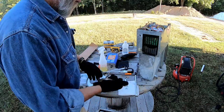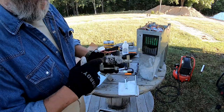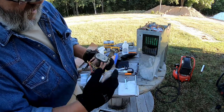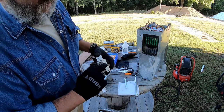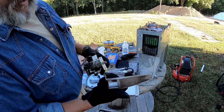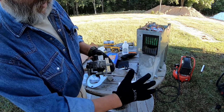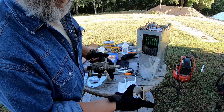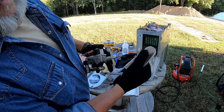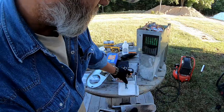Okay. So, if you're not familiar with this thing, the way it works, your propane comes in here, and you've got the solenoid that allows your gas to flow or not flow, and then this is the orifice that diffuses the propane or sprays the propane into the burn chamber or the burner diffuser here, and so it kind of spreads it across here and it burns on the surface of this, and the orifices are a standardized size across here, but now where this dirt dauber nest was stuck to it, the rust has started forming and it's kind of started closing these up.